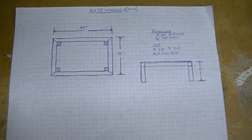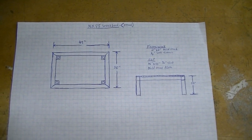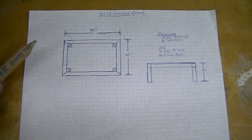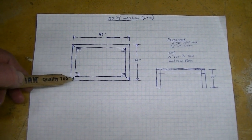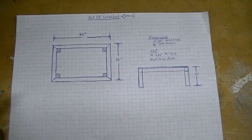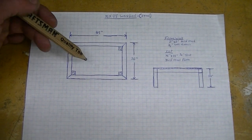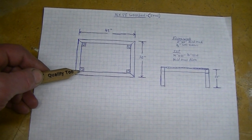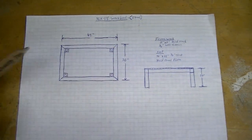That should be pretty much the perfect size. I can stand and work on it without having to bend over too far, but if I need to sit in a chair and work, it's not going to be way high for that either. I'm going to weld this thing together. Instead of just butting the ends together, I'm going to miter them — makes it a little bit stronger and also makes a nicer finish. The four legs will come up through and I'll weld them basically flush with the outer framework, then weld the top on.